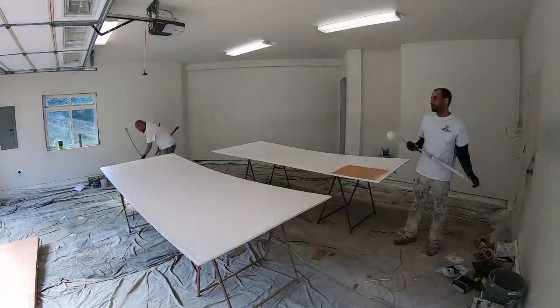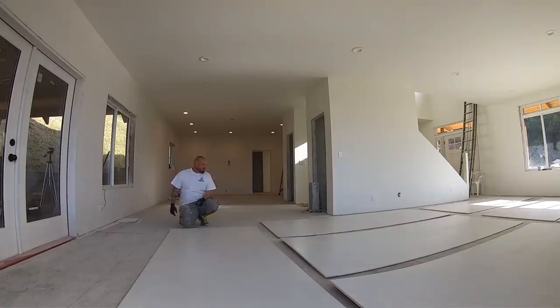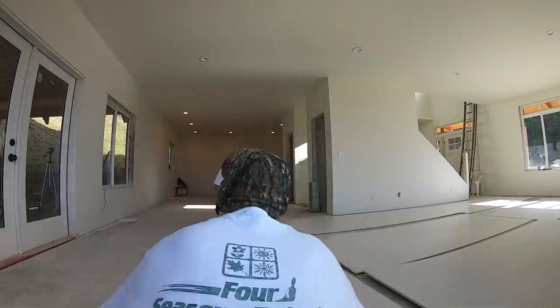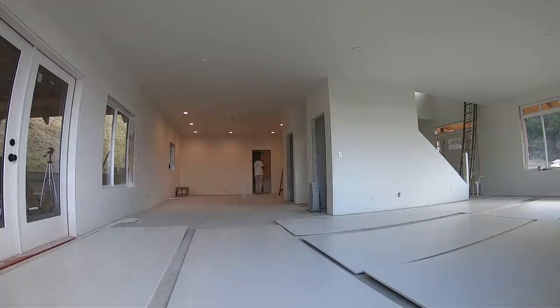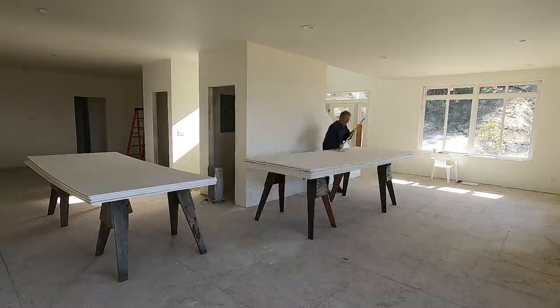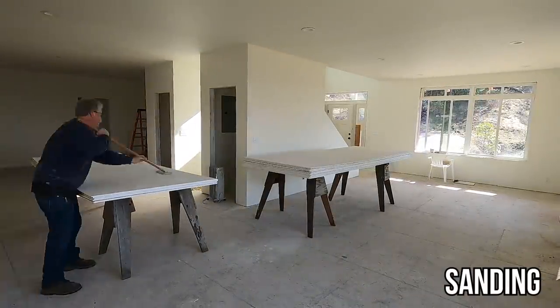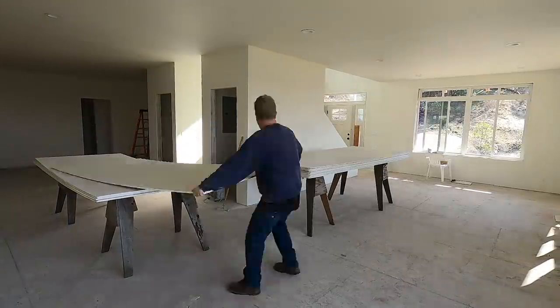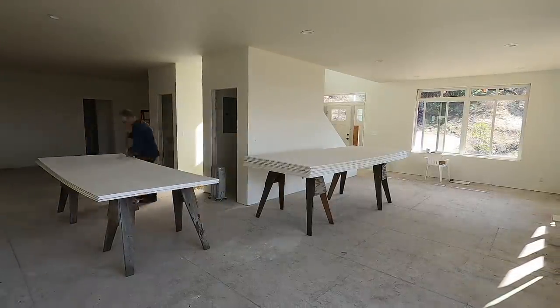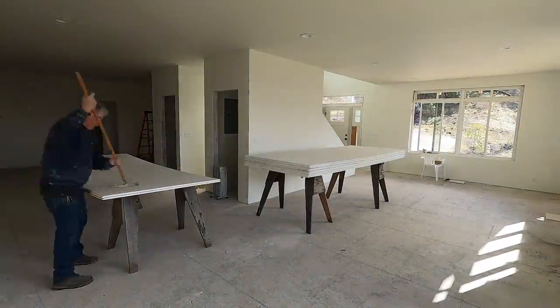There are about 600 square feet of porch ceilings altogether on this job, and that would be a lot of material to prime overhead. The real driver for doing this step first was that the material itself is a 5/8 thick plain face T111 with a ship lap edge. This stuff has a very rough sawn texture and it needed to be knocked down with a light sanding after priming — which is way easier to do on sawhorses than overhead.